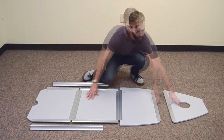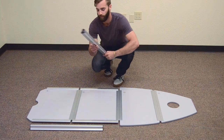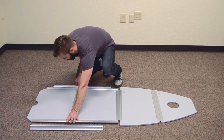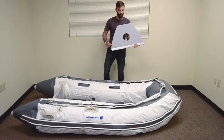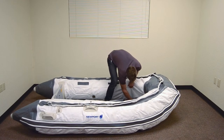The Dana will have four floorboards to install in numerical order. Keeping the long side down and the short side on top, the stringers will latch onto the sides of floorboards three and four. First, begin with placing floorboard number one in the bow, aligning the hole over the keel valve.